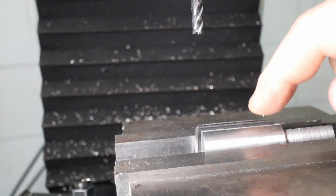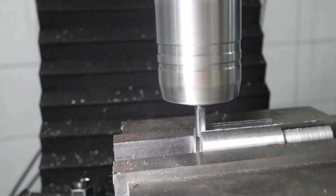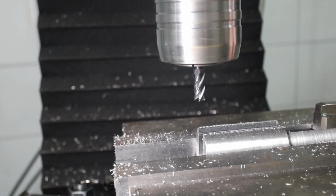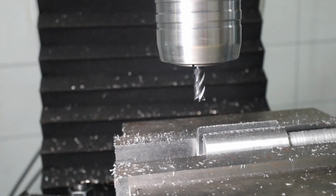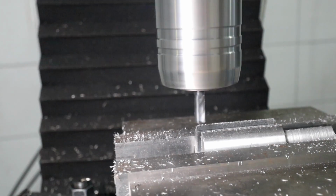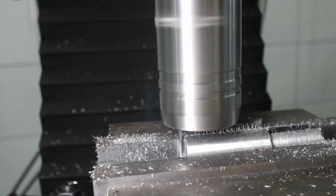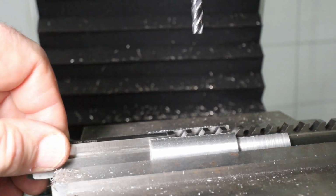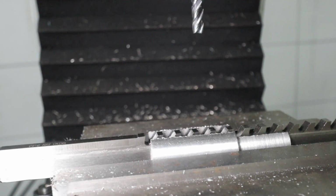Yeah, I think you saw that. The depth of this groove is larger than the flute length, so I have to just take away a little bit there on the top. Yes. Perhaps a spring pass, maybe. Oh yeah, that will be fine. Yeah, then it is awfully deep then. Is that alright? I have to check that.